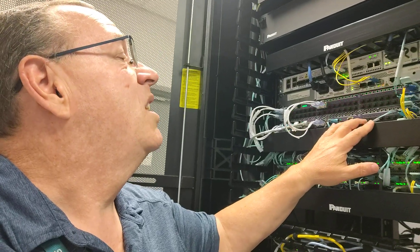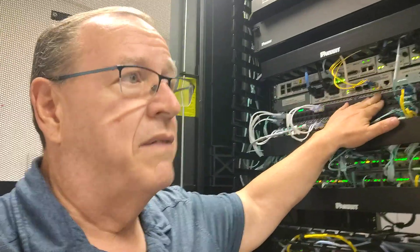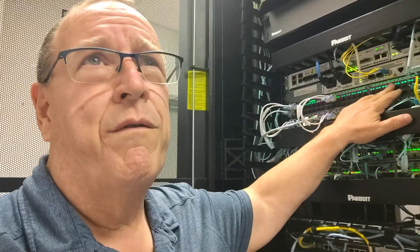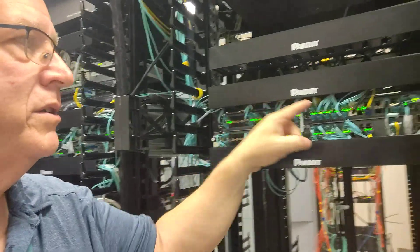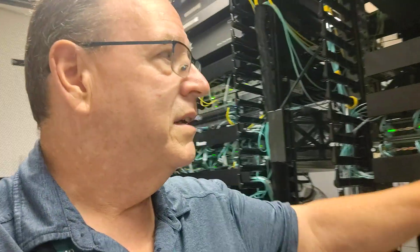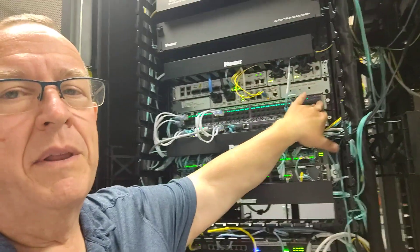The VSP is going to be like a native fabric switch. The other type of switch we use is the VSP 7400 — I believe it's a 7404, but same type of deal, just single chassis, not modular. The VSP 8404 has four modules that plug into it, so it's kind of a chassis. The 7400 is just one single chassis: 48 ports, and then some other ports for stacking and 40 gig modules, mostly used for stacking.